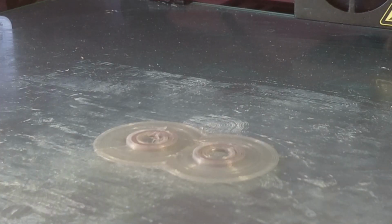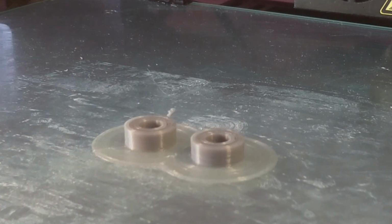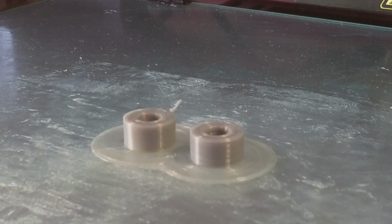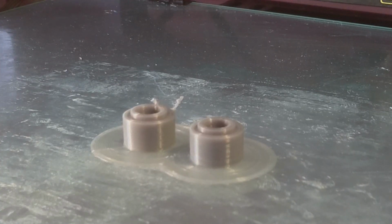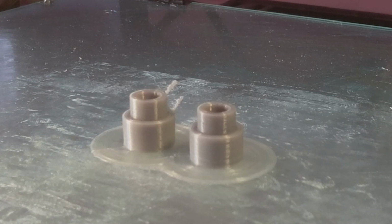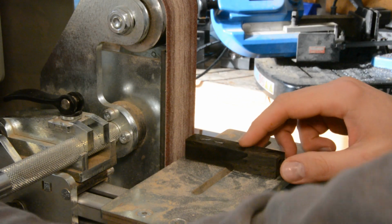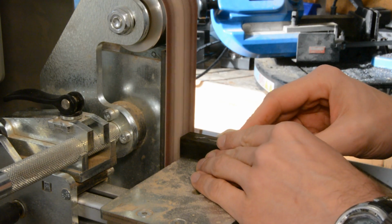While the epoxy cures, we can prepare the mandrel. Each pen turning kit requires a special set of distance rings and their cost add up quite quickly. But with a few clicks in FreeCAD, we have a model for these rings and send them to the 3D printer. The blank was 1 or 2 millimeters longer than the metal tube.